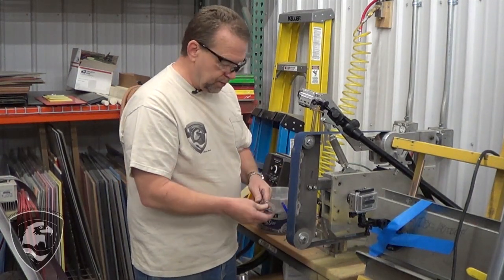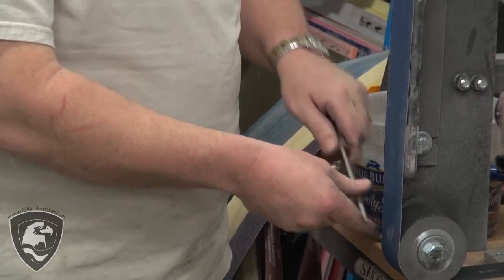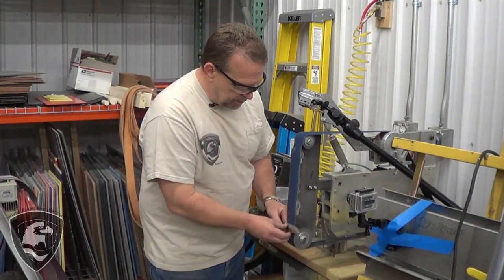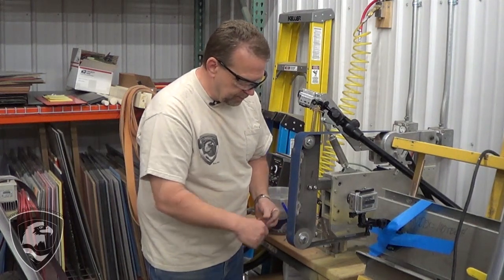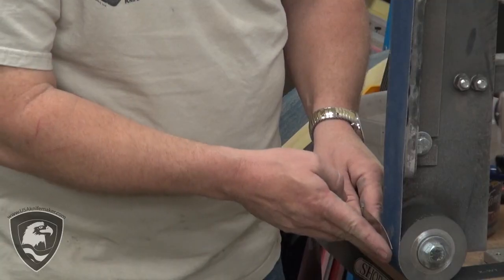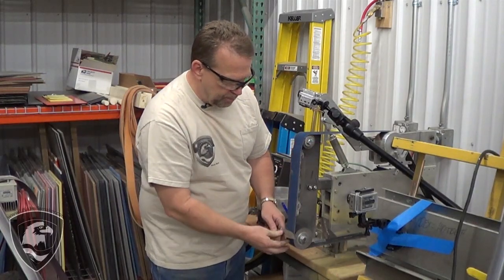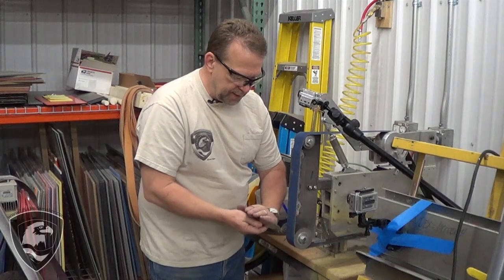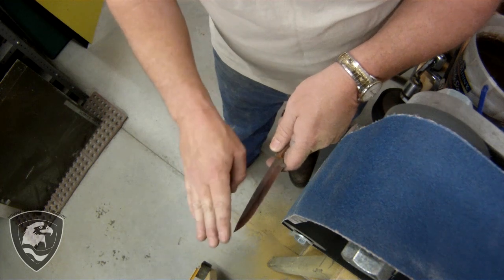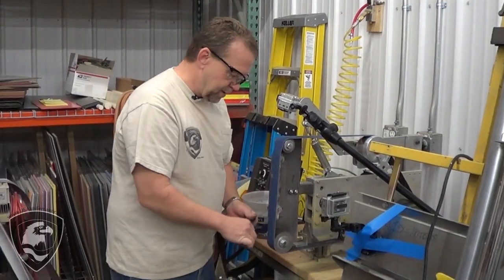I'm going to be making passes edge up for the first few passes and then switch to edge down. If I grind edge up and it catches in that belt after it's fully sharpened, it's going to cut that belt — we're all going to have a bad day as the belt explodes. So I tend to do the initial grind edge up and then switch to edge down just for safety. I'll do two or three passes each side, then start feeling on the back side for that wire burr. As that metal grinds, there's going to be a burr that comes out and I'll feel along the edge to make sure it's consistent and even. When I get that, I'll switch to the other side.